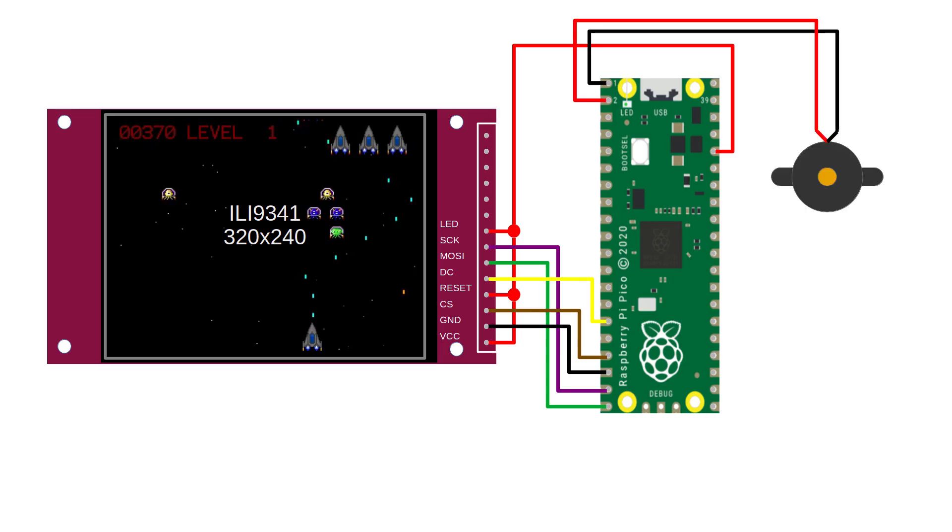For the audio output I'm using a simple PWM based audio DAC, driving a passive piezo buzzer. I'm driving the buzzer with a differential signal, which means I can get a bit more volume just using the I/O pins. It also avoids the need to have any kind of DC blocking component, which makes the circuit much simpler.